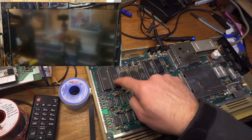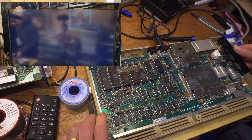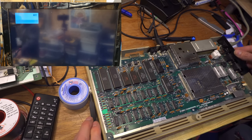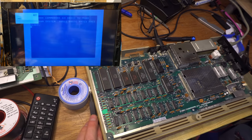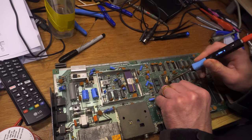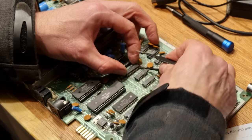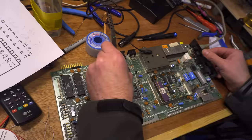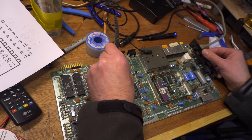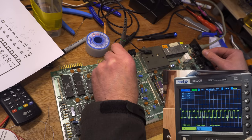To test the CIA I've brought back that C64 from the last video. It went into the socket with a bit of a crunch — and it tests fine. Now we have both CIAs in sockets. What else could it be? Colour RAM next. I don't have a machine with the Colour RAM socketed, so instead I'll just scope the data lines with the chip removed and see if they're the same. And they are — it's not that.